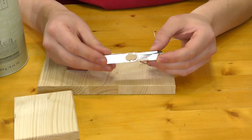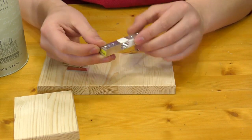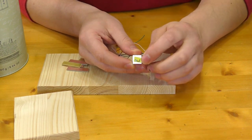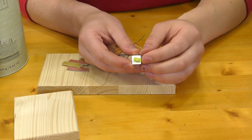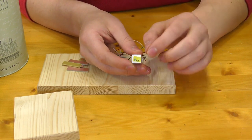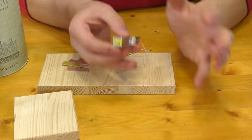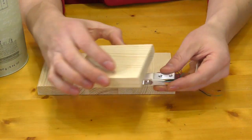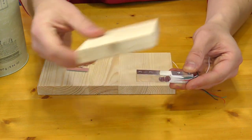On your load sensor, you need to identify which side is the measuring side. You'll find that your load sensor has an arrow on the front alongside a number. The number is the weight capacity — so this is a five kilogram one. The arrow tells you which direction you should put your weighing platform on. In this case it's pointing this way, so my weighing platform should sit this way, so that when it pushes downwards it goes down with the arrow and can make the measurement.